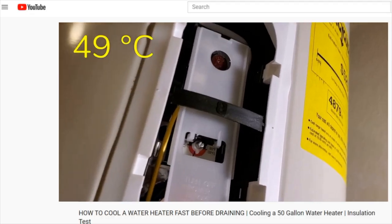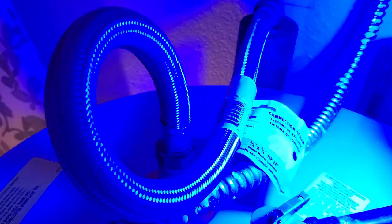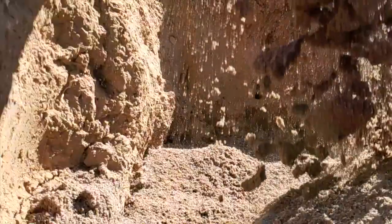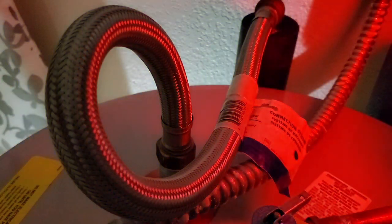If your water heater is set to 120 degrees Fahrenheit, as mine is from the manufacturer, there will be some cooling in the line as it comes out when the new hot water mixes and pushes the cold sitting water down the line. Then the supply pipe will absorb energy from the hot water. Overall temperature stability will lag just because it has to heat up the copper pipe and the cooler dirt around the pipe below the house as it travels to the fixture. It takes a while to achieve and maintain a constant hot water temperature. This is not an instant process.